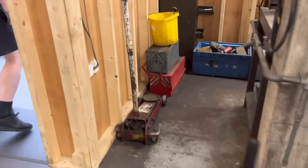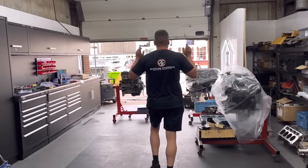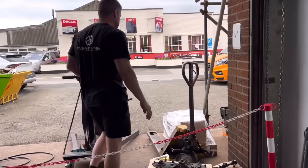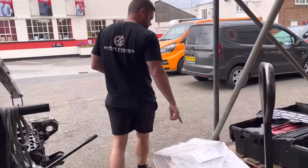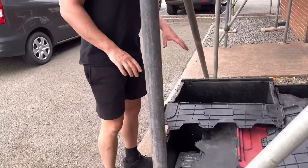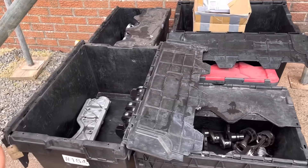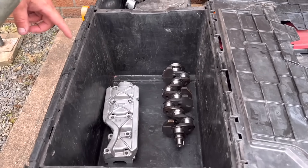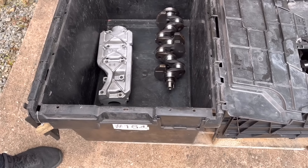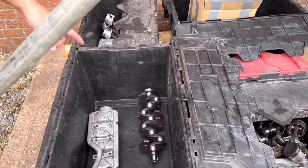That's looking beautiful, isn't it? So if we head outdoors — we've got all the other stuff. This is the box that's got to go. That is the Cosworth that hasn't yet left. So here's all the boxes. We've cleaned the boxes, we've got the crank cradle there, the main cradle which we've blasted. All of those, clean them up. You're just going through changing the pistons on the rods. We'll start on that in a minute. All the cranks are in each of their boxes.